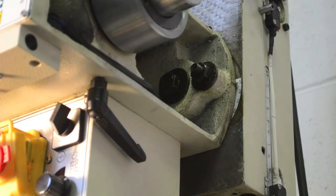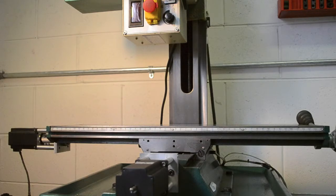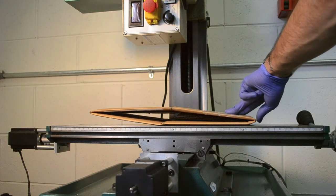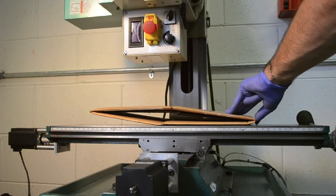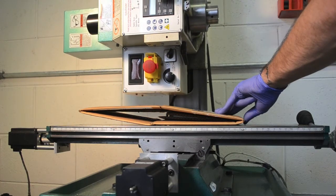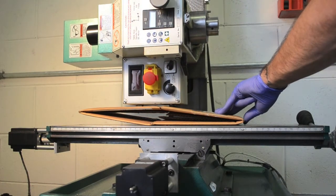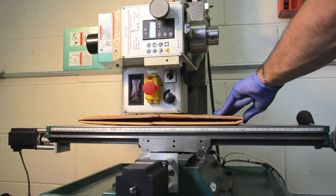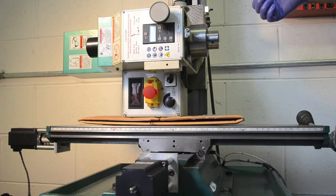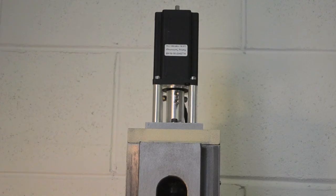I'm going to put some cardboard down on the table and lower that thing down. I've got the steppers up and running — that's that horrible noise. I'll put my cardboard here, actually just a nice MSC box, and just lower the Z carefully, just kind of squishing the cardboard. Now I'll go ahead and loosen up the bolts, pull that off, and pick it up and move it out of the way. Now I've got the whole machine head off — the motor and drive and everything — and I'm going to go up to the Z-axis stepper and start taking that off.